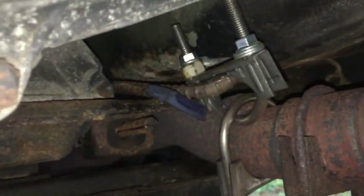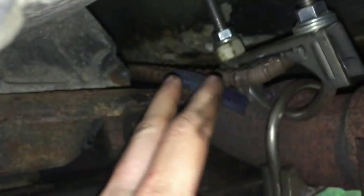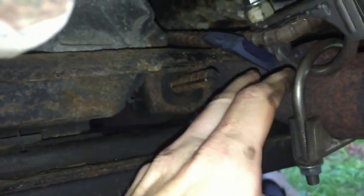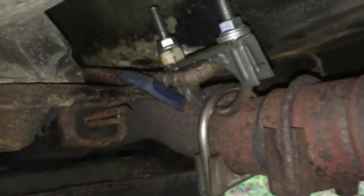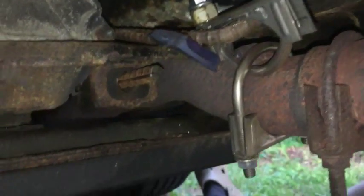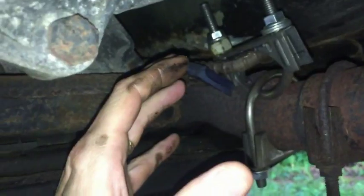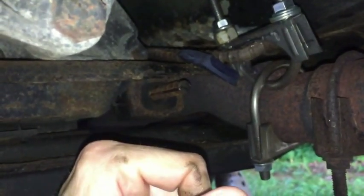Sorry about the camera movement — it's cramped under here. That's another option if you don't want to go through all the bends, but keep in mind the clamp has to keep it in place, and since it's not exactly above the pipe it's going to be pulling it away a little. You may need to use cable or something to support that loose piece before clamping. Anyway, I know it's a lot of talk, but I hope you get the gist of what this is doing. It's been working for me — so if you can't weld your broken hanger, this is an option. Thanks for watching, and until next time, everyone have a great day!